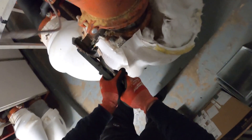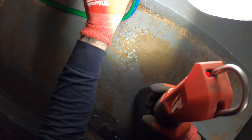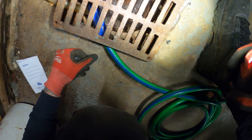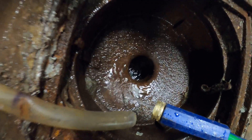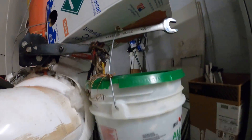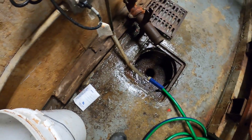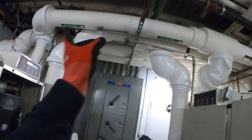These valves are known not to hold, so I'm going to have to rig something up just so it holds. Set up a hose, open the valve, and now we're draining down here. There's a lot of pressure in there — got a small trickle, that's about as good as I'm going to get it. I apologize, but you've got to do what you've got to do. Those valves don't close and I can't shut down the other chiller. My next option would be to shut down this chiller and get to the main valve, but I'm going to go for it.